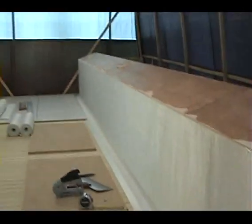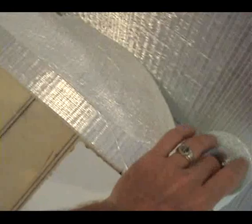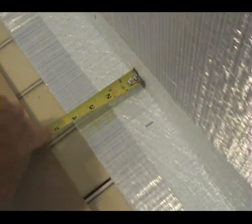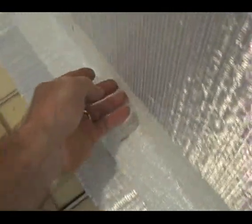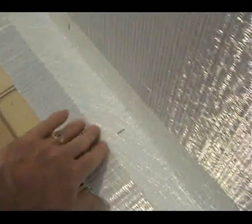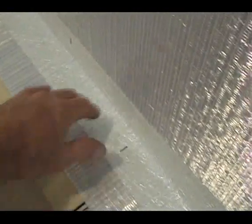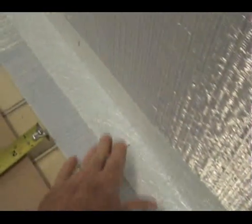That's all done the whole length there. And then the next thing I'm doing is putting in this piece of cloth — the same cloth. I've made myself a four-inch wide roll that I fold in half, so I have two inches on the bottom and then obviously the other two inches on top. That's so that when I add the resin, it'll adhere to the section underneath the pontoon and then this new side that I've added.